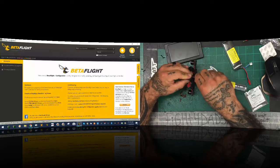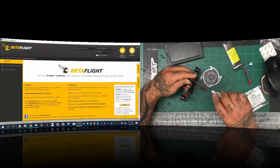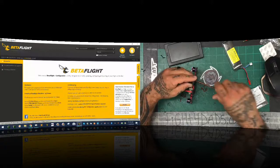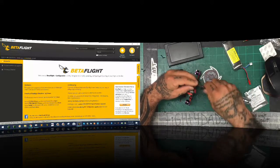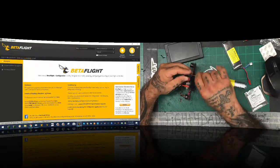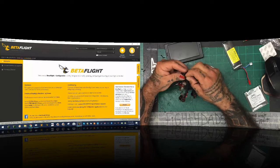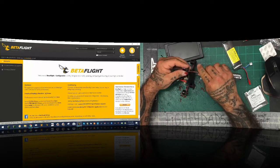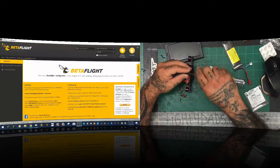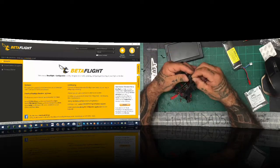I'm trying to screw that screw and it's giving me a little bit of a problem, which means I probably don't have these aligned perfectly center. So — loosen your other screws, don't just try to crank down on one that's giving you a hard time. Loosen the other ones and there — see, now they all go in without issue. These things don't have very much room to give, so if it doesn't go, don't force it — loosen the other two screws and it'll probably bring that opening closer to the threaded area.